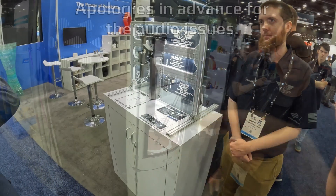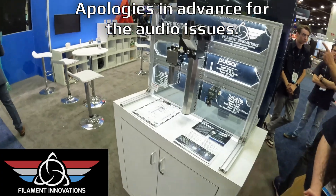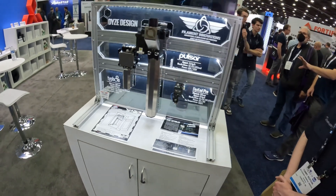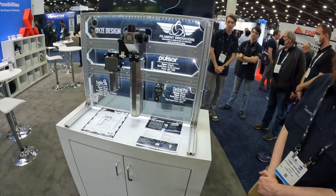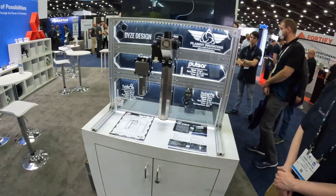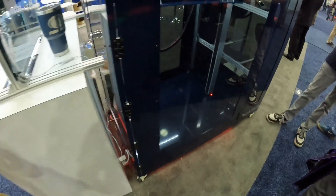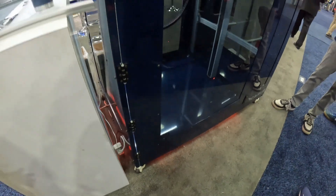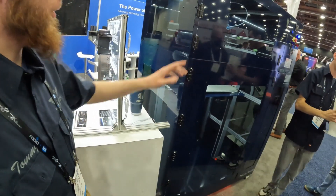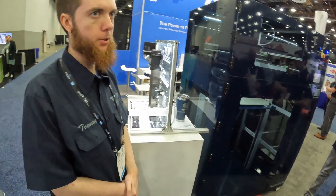That is a big hot end — 2.5 kilograms an hour or more. I'm used to like 18 cubic millimeters a second. Which machine is this? An Icarus — the medium-sized one. It uses a medium-sized extruder. It's pellet fed? No, this one uses filament but it's still high flow — it can do up to 200 cubic millimeters a second.